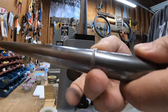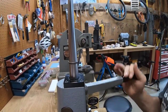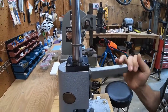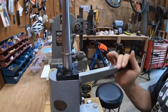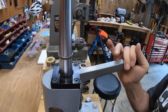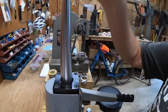Okay, I'm at 12.25 now. I don't know if you can see it, but I'm at a size 12.25. Let's just take a chance here. Let's live dangerous. Let's see if we can get this thing up to a size 13 before I anneal again. Just the same old process. Just do it enough to close up the top where you have full contact with the ring, then flip it over. You're just essentially stretching the bottom each time, only stretching about half of the ring each time.